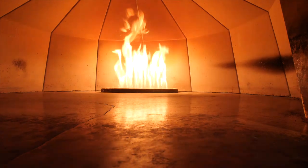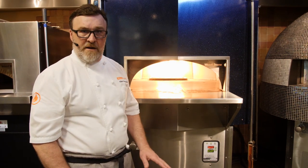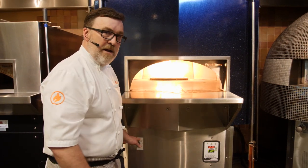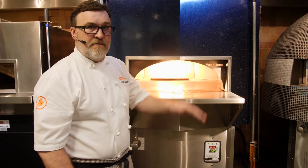I'm going to leave this flame set at 5 until I'm approaching my set point, my desired floor temperature. If my desired temperature is 550 degrees, I will wait until it gets up to about 520, 530, and then I'll back this flame off and allow that floor to just ease right into where I want it.